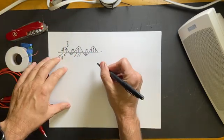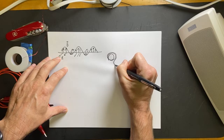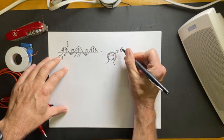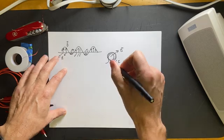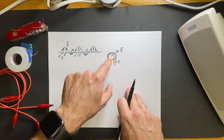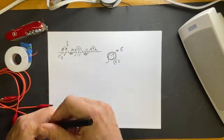There's a coil of wire. If I have a loop of wire that goes around multiple times like that, and I have a magnetic field through there, and that magnetic field is changing, that induces a voltage across here and you get a current out. So this coil of wire picks up a changing magnetic field. There should be an electric field also, but we're not detecting that directly. So let's go ahead and build this — it's not too difficult.